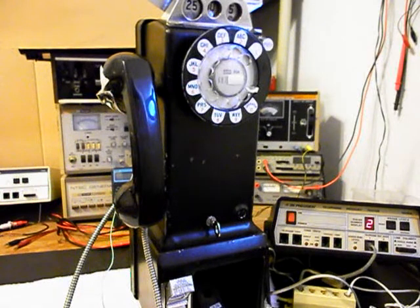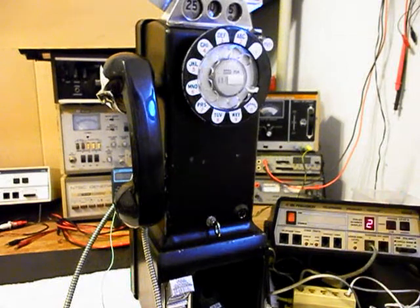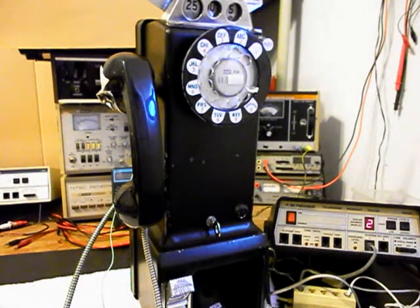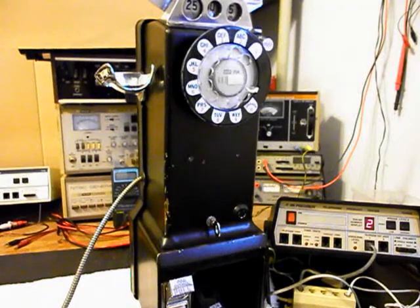Now that we know that this unit is ringing in on a ring cycle and it's dialing out, we have transmit and receive. We can go ahead and press the button on the switch box — that gives us a line out, totally takes the analyzer out of the situation — and we'll call the time and temp number. We'll go ahead and give you some dial tone and we'll make that call.